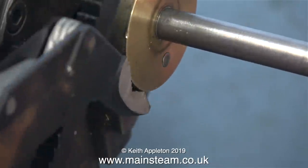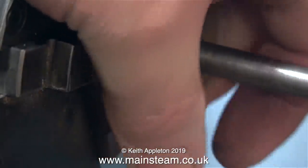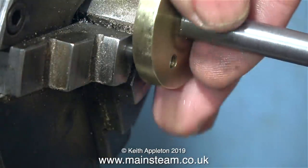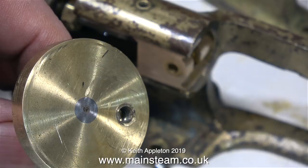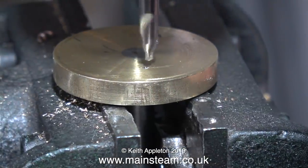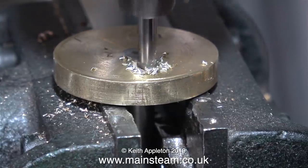With the crank pin firmly held in the chuck of my Boxford lathe, I'm using a Bahco adjustable wrench to remove the crank web from the crank pin. If you've been following this series, in an earlier episode I did mention that the crankshaft was a bit bent, so I'm going to make a new crankshaft and crank web anyway. But before I do, take a close look at this image — particularly the center of the crankshaft part in the middle. The center hole in the crankshaft isn't in the center of the crankshaft, which is very odd. No matter, because for the moment I'm going to use the old crank web and I can drill as many test holes in this as I like, since the part is scrap.